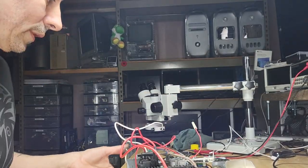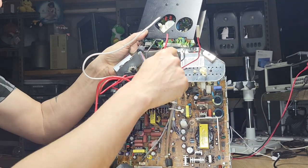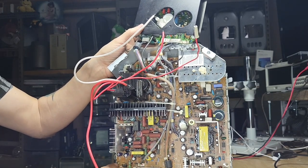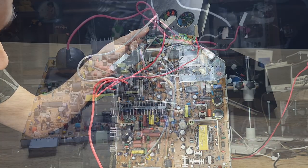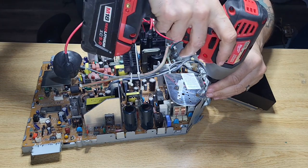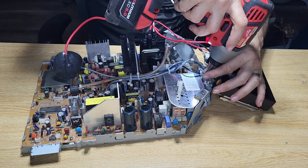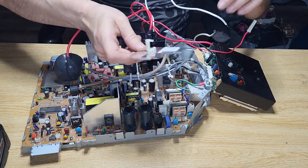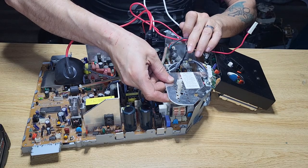Okay, so there's a few screws in there that need to be taken care of. One of them requires removing the shield here, but there's one Phillips screw sitting here. And you got these little guys. You got the gold one on each side. You got a gold one with a big flat washer sitting here. Don't be too hasty. That one's also the ground. It does have a tiny little lip in there, so it sits right in here. So it's pretty easy. There's only one way in.